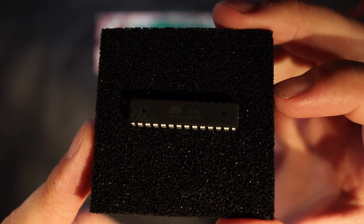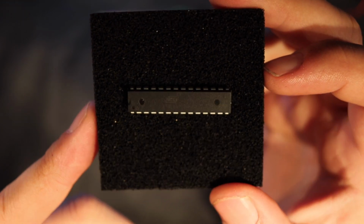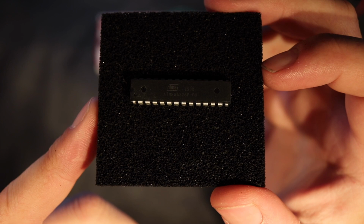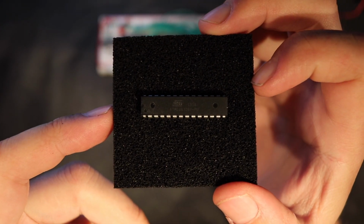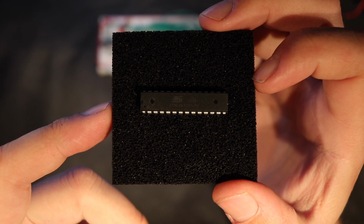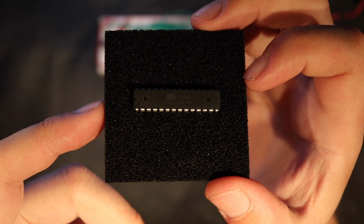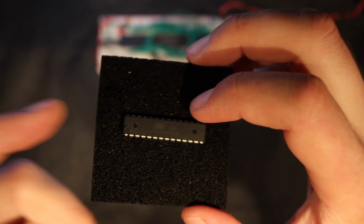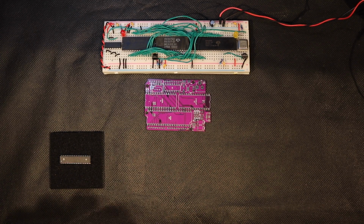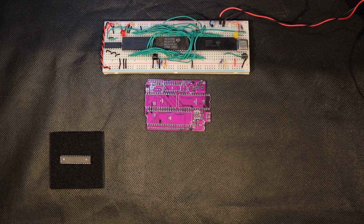Of course, the main IC on the Arduino Uno, the Atmega 328P, has quite a few more features than the 6507 plus 6532 combination we used on the breadboard. But even though it doesn't have analog pins, needs an external clock, and the Atmega 328P is generally better in every way, it's also over 30 years newer and hides everything away in a single package. And that makes it harder to visualize what's actually going on, and why would we want that?